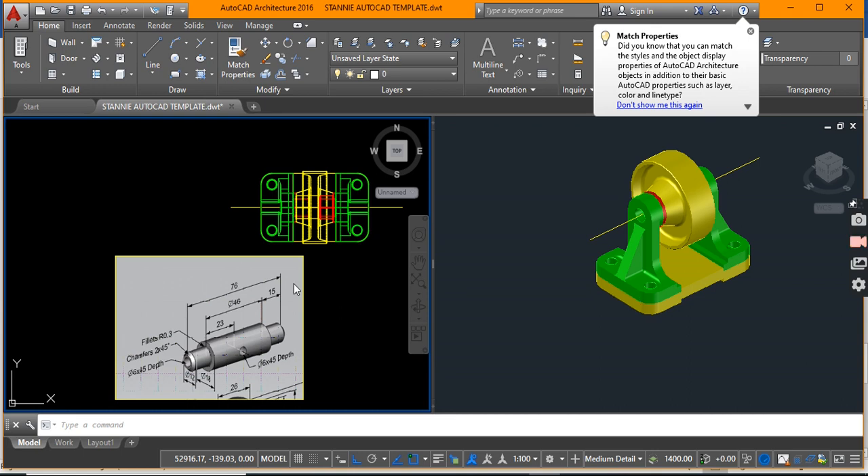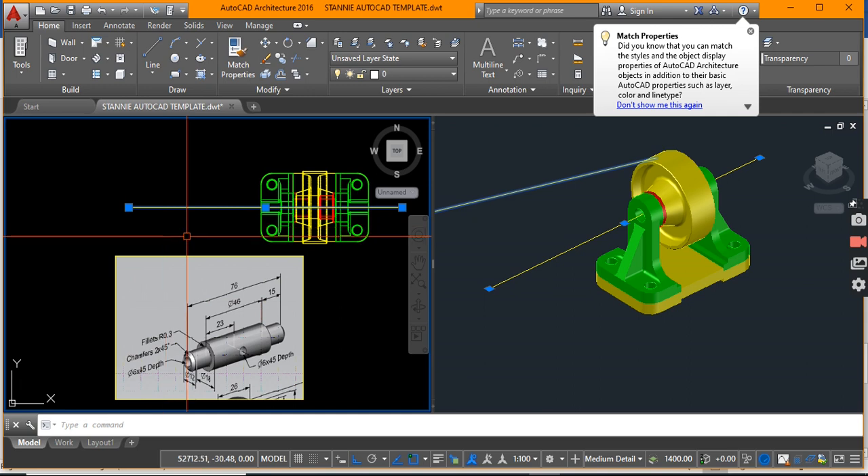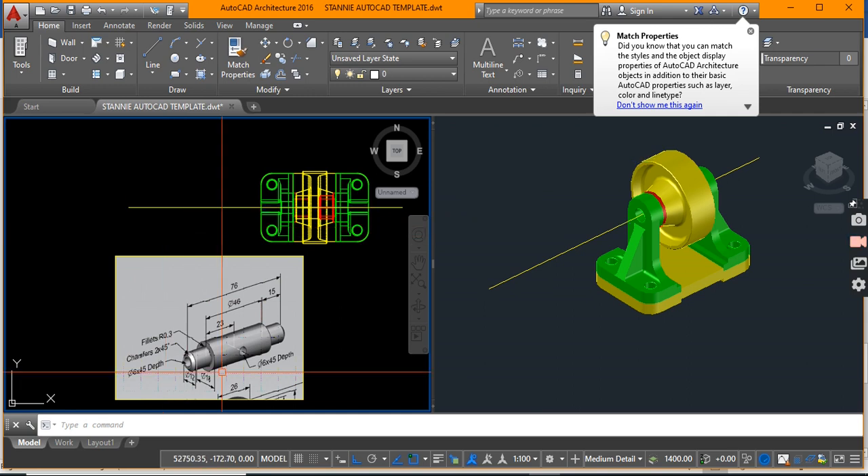Allow me to just extend my center line, considering I would want my axle to be produced on that same center line. From our diagram already copied, we realize that our axle is produced using two different diameters. The smaller diameter, which is the part passing through our end plate, has a diameter of 12, and the part passing through our bushing will have a diameter of 18.